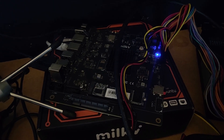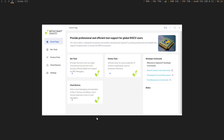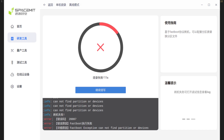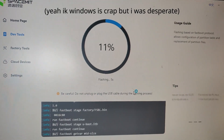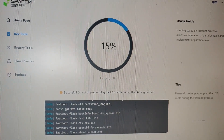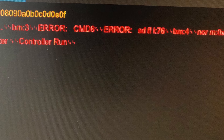So what about an SSD? You'll notice the board has a USB-C port, and that's used to flash an OS to an eMMC or NVMe drive using a tool called Titan Flasher. On paper it should be easy, but whenever I tried it I just kept getting errors like "compare CRC fail." I tried everything: different images, different computers with different operating systems, different SSDs, different USB ports and cables. I tried flashing it manually using Fastboot, which is part of the Android platform tools, and I even tried debugging over serial — but nothing worked. I honestly couldn't figure out what the problem was, and even if I did, it probably wouldn't be something I could fix myself.